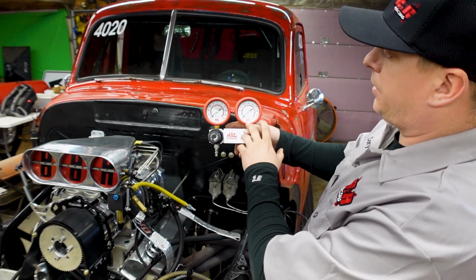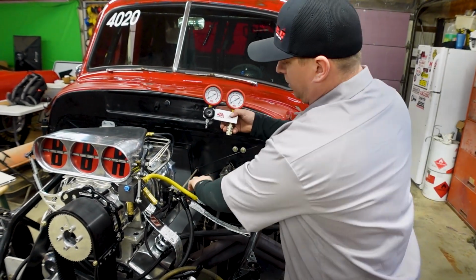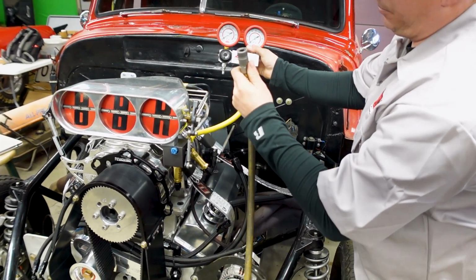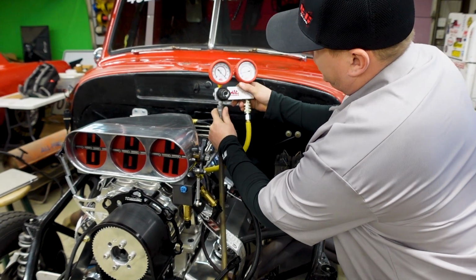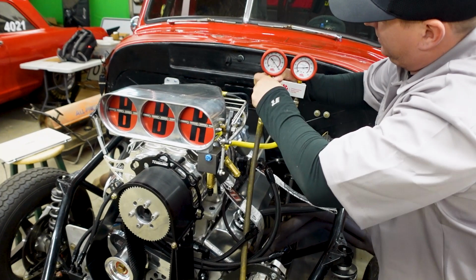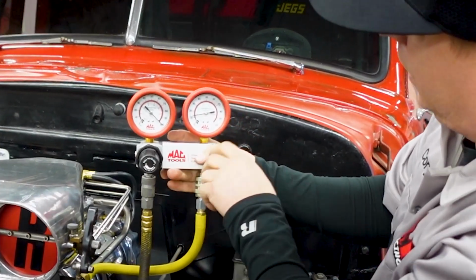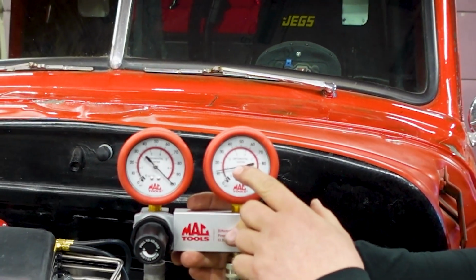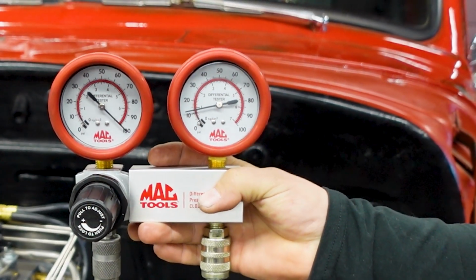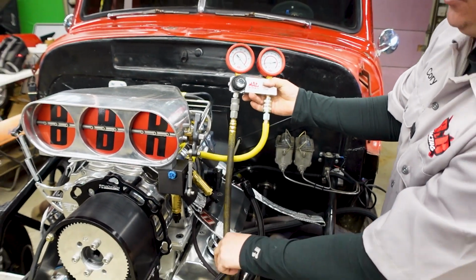Spud at FIE recommends I start out at 25% leak, so that's what we're gonna set this at. The first thing I do is put the supply line in, and then I take my air supply and connect it. If I need to do some adjusting, I'll adjust this until I'm exactly at 100 pounds, which I am. As you can see, I'm a little low. I'm at about 12 pounds differential, which is the leak by. So I need to adjust the barrel valve nut in order to get that to 25 pounds. I'm gonna go ahead and loosen this assembly, and I can make an adjustment.